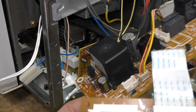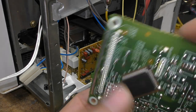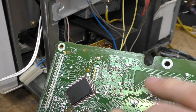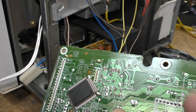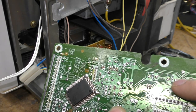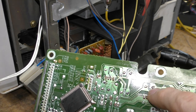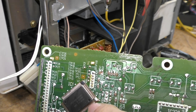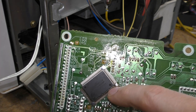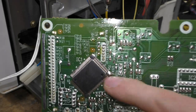We had 5 volts, but the micro is still dead. There were 5 volts getting to the micro, but there was no signal at the oscillator. It turns out the keys are run by a matrix, so all the keys are connected to a pin on the micro, and one of these keyboard lines is now measuring as a short to ground. Obviously what's happened is that mains arced over to this pin and stuck high voltage down the pin. That may well have caused a latch-up, so the 5-volt line provided the additional energy needed to actually destroy the chip, and that IO pin is now shorted directly to ground.